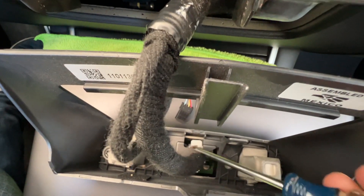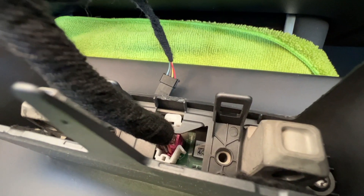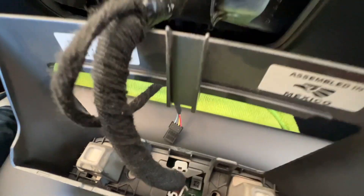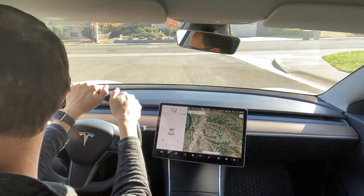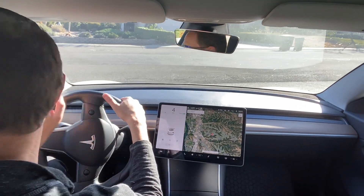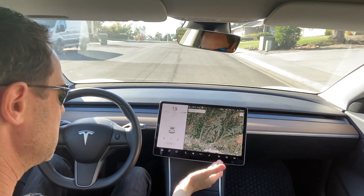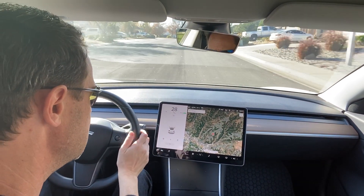Now, what about the OEM part with the lip that I thought might be there to hold the cable in place? Well, it may have coincidentally held the plug in place and bought me some time, but with broken solder points, it was only a matter of time before the connection would fail. I said the lip coincidentally held the plug in place because the newer models don't even have it, leading me to believe it's not even necessary. So when I said the designers of the tilting screen overlooked this part of the design, I was clearly wrong because it's not even part of the current design. Which brings us to the original mount I installed over two years ago from Matt at Tech Forum — since the lip isn't part of keeping the plug in place, and the original mount stayed in place without swiveling, the mount has nothing to do with the broken solder points on my screen.